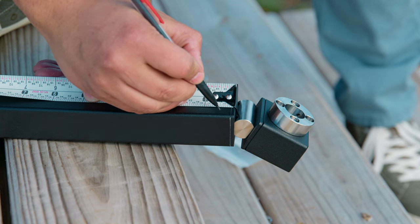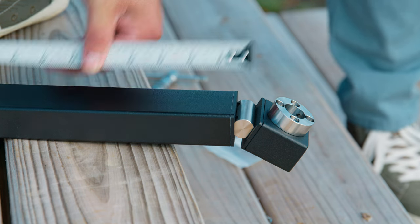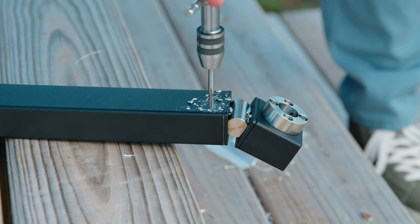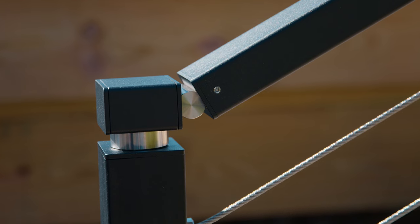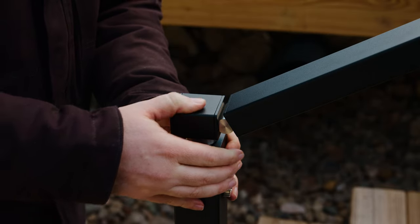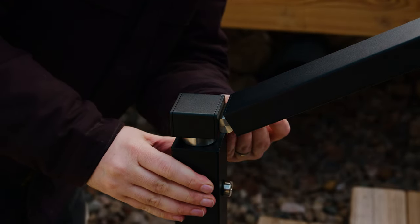If we wanted to add set screws, here's how we'd accomplish it. We'll mark and drill two holes on the underside of the handrail, each hole a half inch from the cut edge and a half inch from either wall. We'll drill an inch deep, going into the handrail hinge plug — not drilling in the center since we would hit the screw from the handrail hinge. We'll tap these holes using the same process as earlier, then secure each hole with a half-inch set screw driven in by our 3/32nd Allen wrench. If the space is too difficult to work around, we could instead install a set screw through the sidewall of the handrail. We'll take this section of handrail and kick out assembly, slide it onto the handrail hinge at the other side, and lock it into place by securing the post top collar onto the center pin of our bottom post.